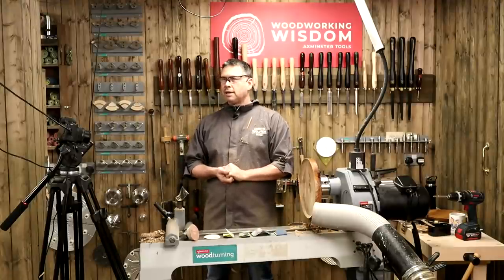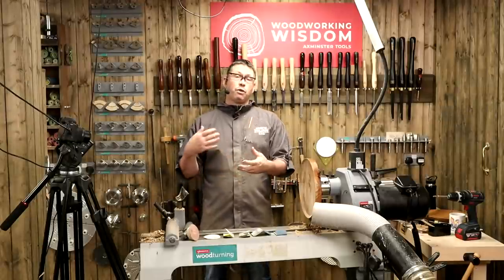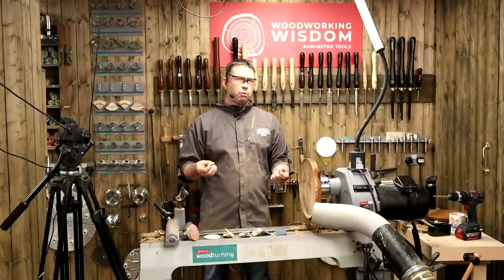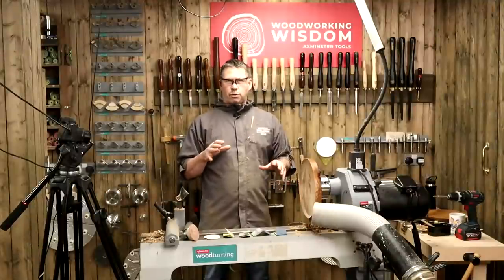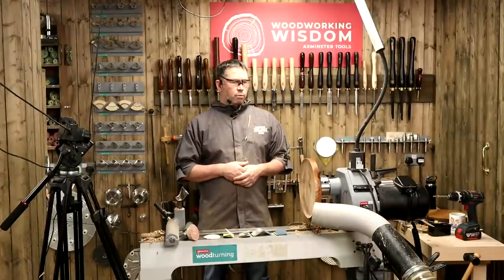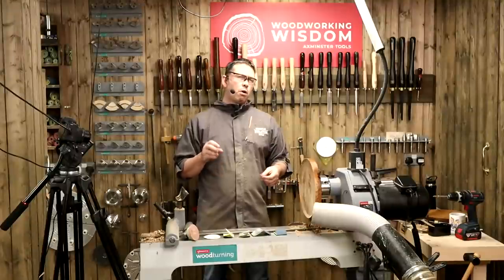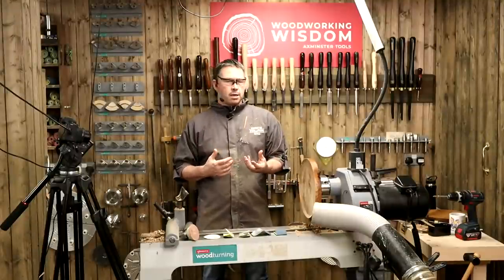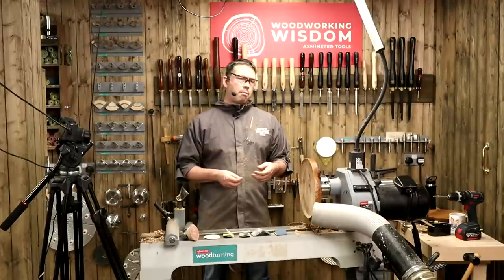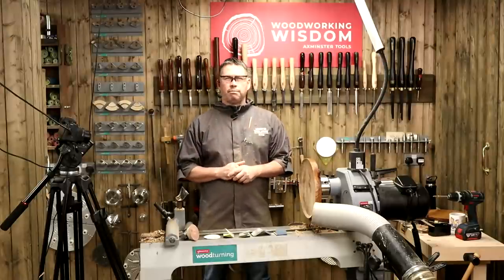And then Maria's asking, would holly be okay for this? Yeah, holly would be absolutely fine. Again, same thing, Maria. If you've got it dry, perfect. If you haven't, it just takes a little bit more to dry. It's very susceptible to woodworm. Just watch your storage and your drying time. Drying is very much one to be careful of. And also just bear in mind, it does move quite a lot as well, just because of its density. So if you're rough turning, expect a few more losses. Just dry them very slowly.